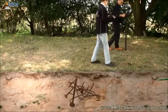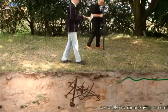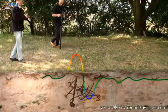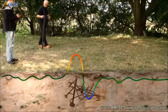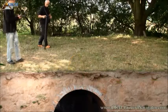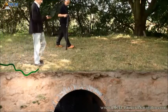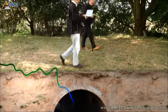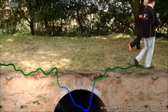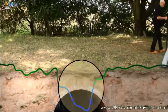Another typical signature is very special to ferrous metals like iron-based objects — the signature is a positive and negative amplitude. The third signature is indicating voids like tunnels or chambers without any metals. This signature is only a negative amplitude.